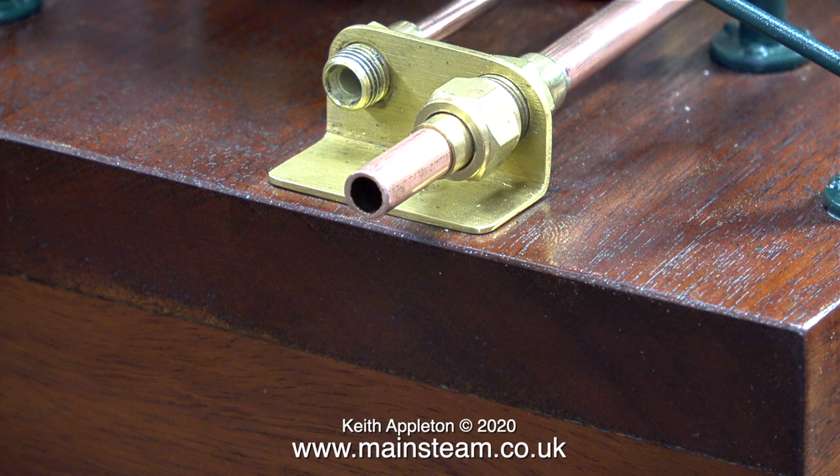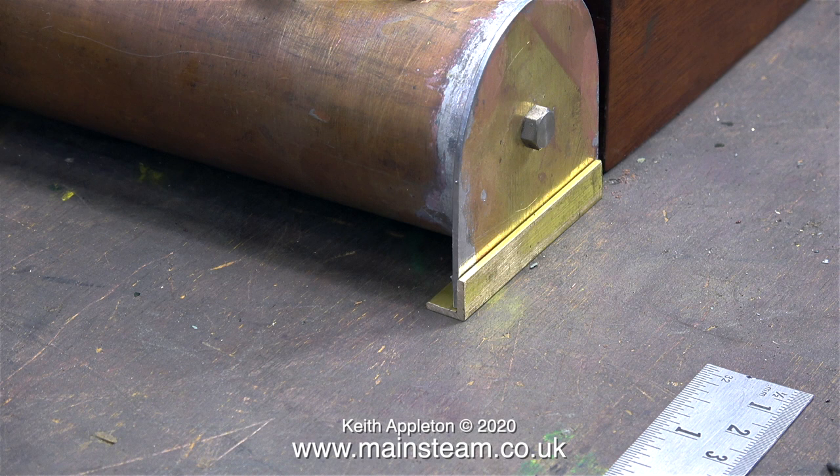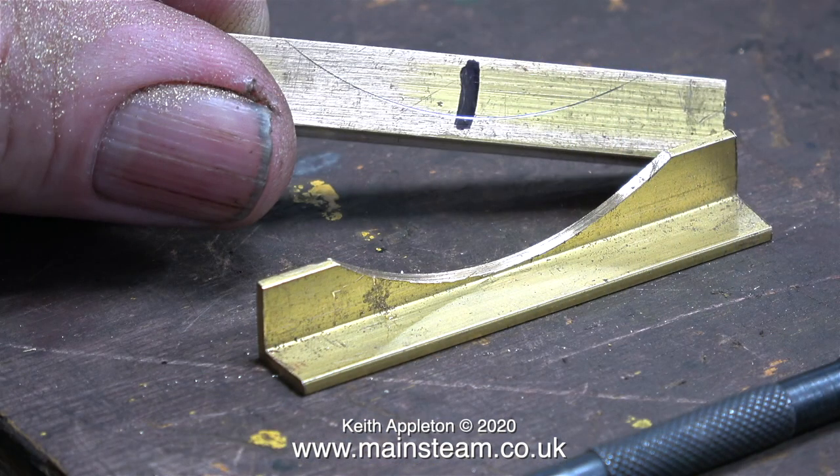Now I need to drop the height of the condenser by cutting the plates on the end of it, and I also need to add a small amount to take into consideration the brass angle that I'm going to solder on the end of each of the feet. Should I solder the two pieces of brass angle like this? No, that looks horrible. I need to turn them round and solder them the other way. The problem is they no longer fit because the tube is too low down relative to the end plates — I need to cut out part of the angle so the tube fits onto it.